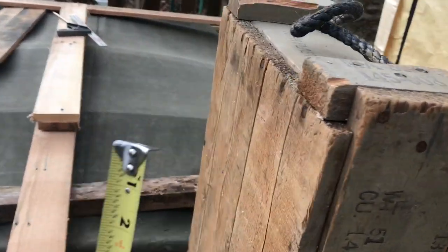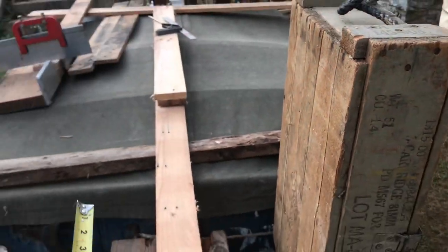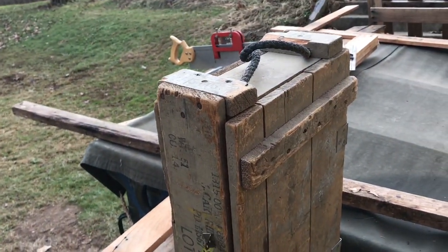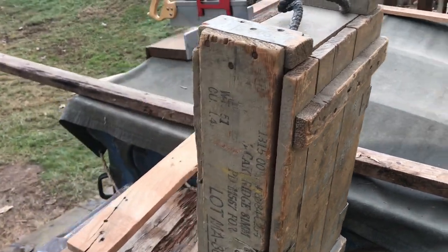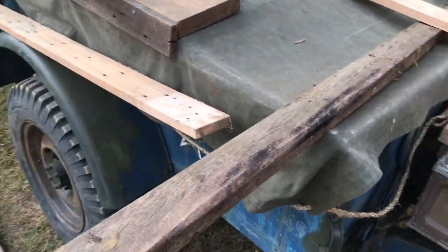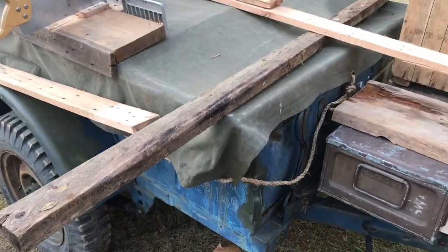Going the other way, you can see it's pretty much two feet tall, so I won't have enough lumber from one pallet and I'll have to tear another one down. The top and bottom boards are going to be 24 inches, and the front and back are going to be 26. I'm going to cut the corner blocks — originally one by two with half-inch rope, but I'll make mine one and a half by two for three-quarter rope, so I'll rip a half inch off this board.